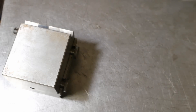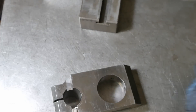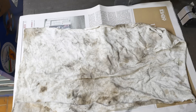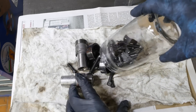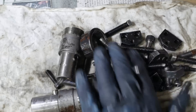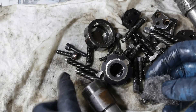The other thing I was up to this week: I just went through and cleaned off the rear mounted tool post holder, which you'd use for cut-off tools and stuff, and also went through and disassembled and cleaned all of these tool holders that I was given. I took all of the hardware off them, gave them a good clean up, put all the hardware through the ultrasonic cleaner. That all now needs dewatering and oiling. There's a little bit of rust on these collet chucks.